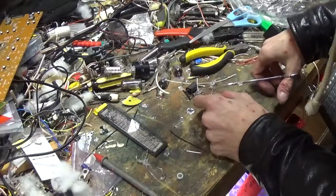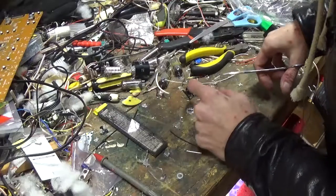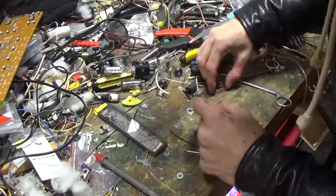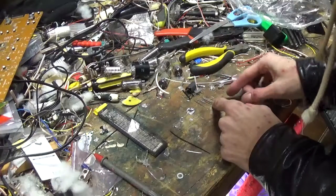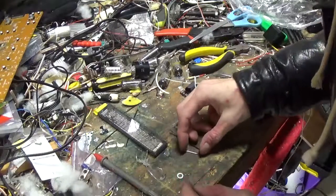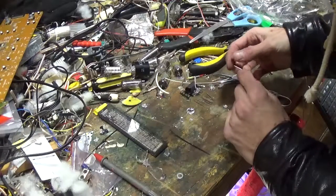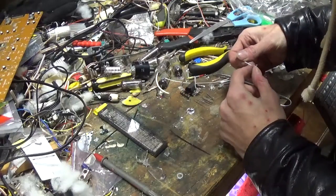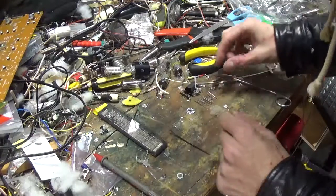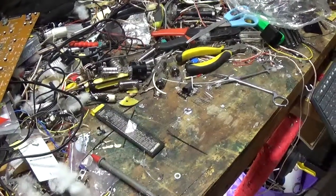Oh, it's magnetic. Of course. It's alright, I can line them up for the most part. Mind you, each one of these grids sits in between the other ones before it reaches the plate. Okay, here's the cathode. Directly heated cathode. That material on the wire there, that's part of the heating element. I know that can emit too, though, for the most part.